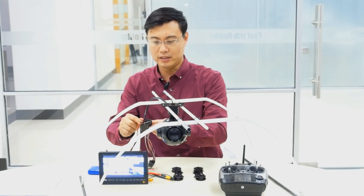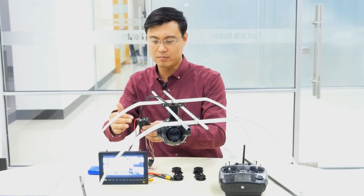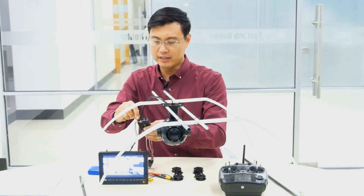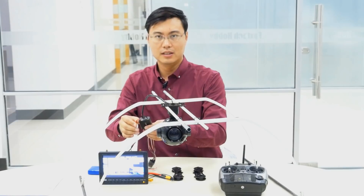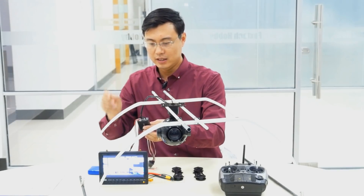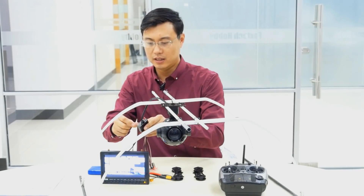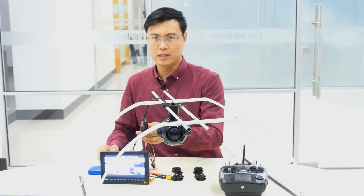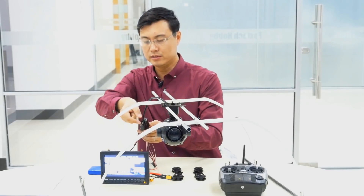The camera and gimbal are controlled through this integrated controller box. All wires come out from the gimbal and camera into this very integrated port right here. The power supply port supports 3S to 6S LiPo batteries — that's 12 volts to 25 volts, a very wide voltage range. We also have an HDMI output, so if you have an HD video link like DJI Lightbridge, Lightbridge 2, or the DVL1, you can link the HDMI port with a wire to the transmitter to see HD video at your ground station.